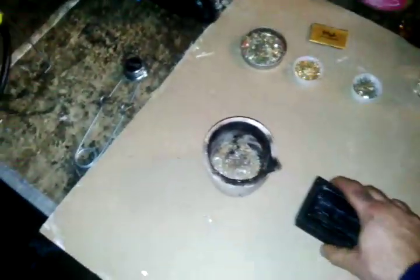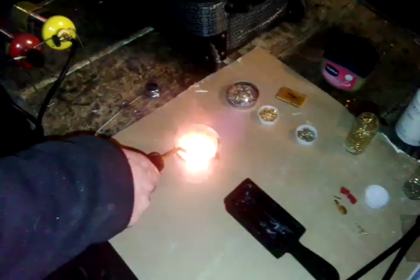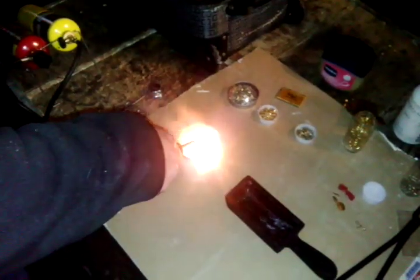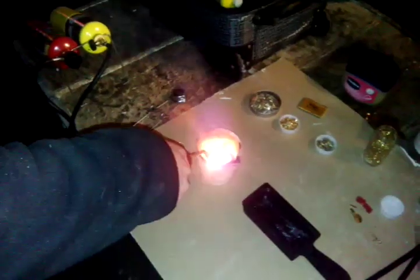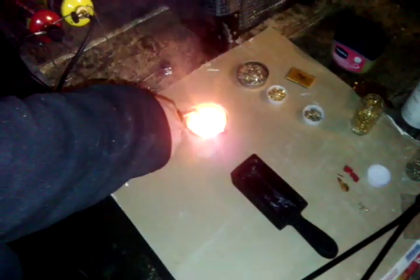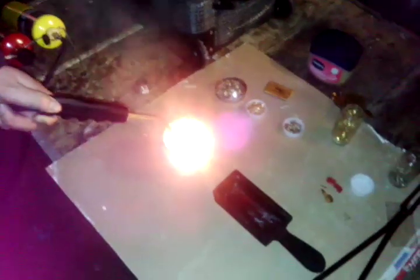This is my buddy Matt — are you ready to start melting? By the way, this is not a regular propane torch. This is map gas and oxygen. You can't melt with regular propane — it won't get hot enough. This setup cost me about $27 for two canisters, and the torch setup was about $50, available at Canadian Tire. Always light the map gas first, then introduce the oxygen. The oxygen tank is always the red one and the map gas is always the yellow one — never do it the other way around.